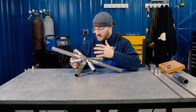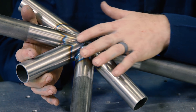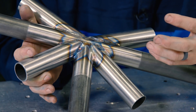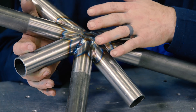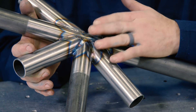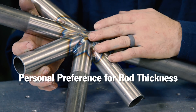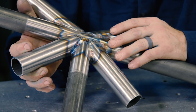Here we have our finished piece. We've got two different choices as far as our size of fillet weld. On this one we're just using a 0.045 for one single pass — one and done. Some people prefer for thicker material or personal preference to do a weave or a cover pass. On the lower one, I used a 0.035 for the root weld, kept it smaller and cooler, and then a 0.035 on the cap pass as well. Based on my style I prefer to use a little bit thinner rod, but it's totally personal preference. So 0.035 on the root and cover pass and 0.045 on the single pass.